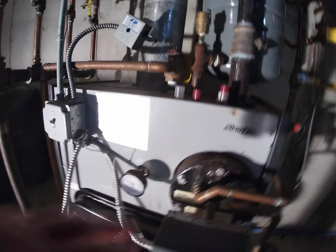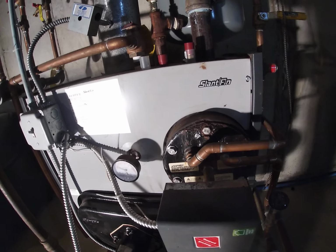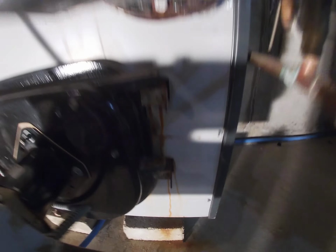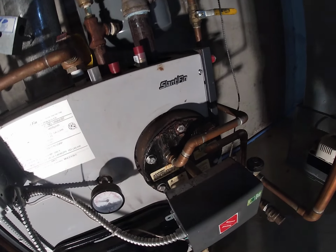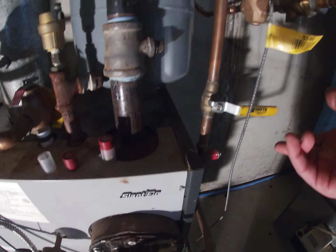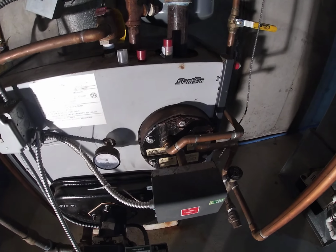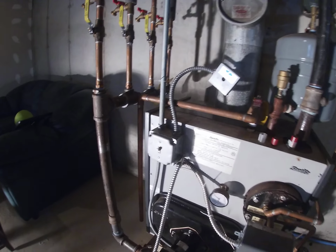You can see, because these can be replaced, you can take this whole chamber out, put a new one in, and it'll work, and it'll work better. But it's still an inefficient way to heat. And you get some leaks in the summertime because it's sitting. The gasket doesn't get heated, doesn't expand. So I shut this off. It's bypassed. But in the event that I needed hot water, I can lift this valve, change the settings on my control, and it will produce hot water. Not efficiently and not at a regular rate. So I installed a different system, and I will show you that system now.